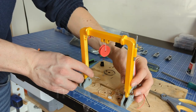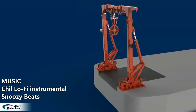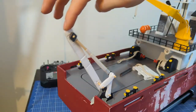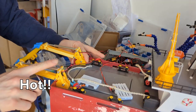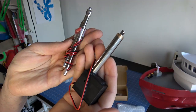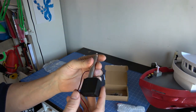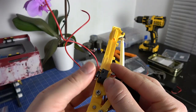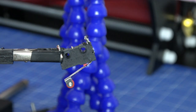Now it's time to tackle my last requirement: the A-frame. I saw something that pivoted like this and made a couple of prototypes. I ordered some cylinders that sadly broke in less than 5 minutes, but I found these ones instead — they're strong but not as scale-looking. To be safe, I adapted my design to integrate these limit switches, then slightly modified the switches so they fit inside the frame, and printed the final version.